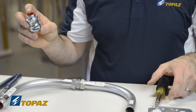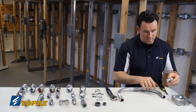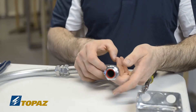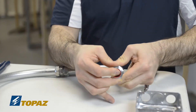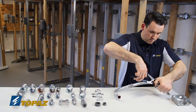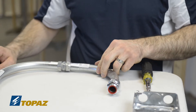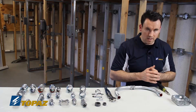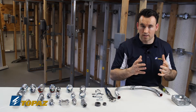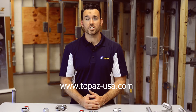The EMT compression connector — this one also has an insulated throat. I just have to loosen it, not take it off, and slide it on. Once it's on, I hold it in place and grab my channel locks to tighten it. You may need a second set of channel locks to make sure it's securely fastened. The EMT compression connector has to be securely tightened down with channel locks to secure the connection, make sure no moisture gets in, and prevent it from coming loose due to vibration.